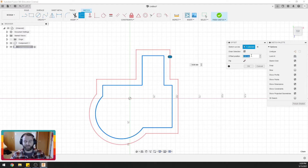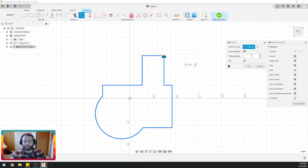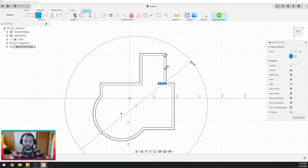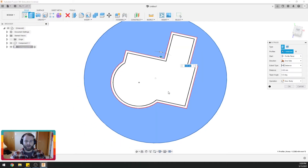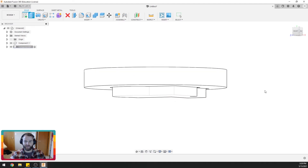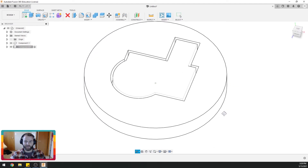If we're doing 3D printing and you want a tight fit, it's normally going to be 0.1 millimeters. If you want a pretty standard fit, 0.25. If you want a loose fit, 0.5. But we'll just do 2.5 so y'all can see, and then from there you can do anything else you want and you've got two pieces that'll fit right inside of each other.